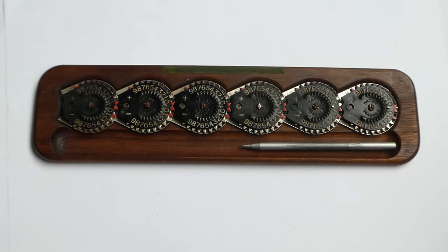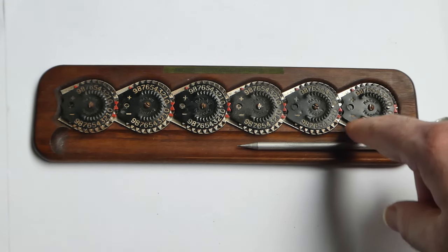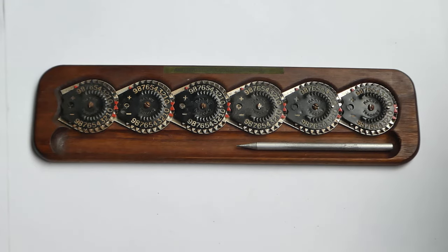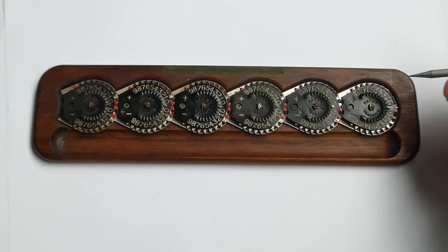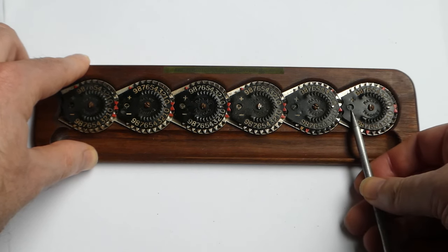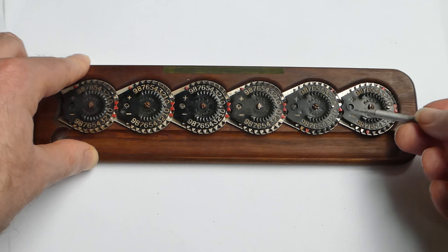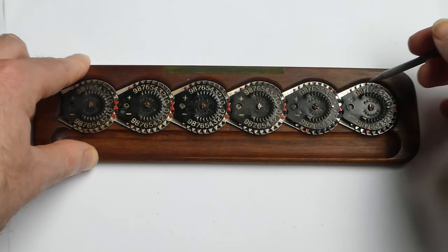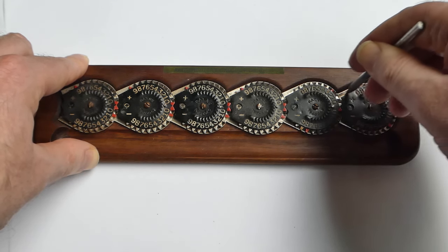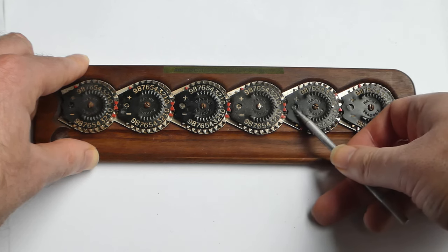The Behr Fulton calculator is essentially the same thing, but the sliders are curved around so it's now a round gear, and they've curved that around to connect up to the next dial. You take the stylus and just add the digit that you want. There are windows here showing the current value — it shows a seven and a six. If I now add another six, I'm between the white teeth instead of the black teeth, so I can't move it all the way to the right. I have to move it left and then automatically down to perform a carry on the next digit. So that's 82.